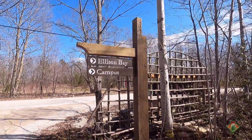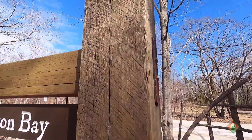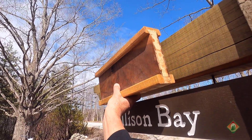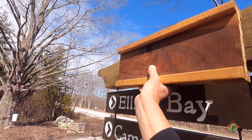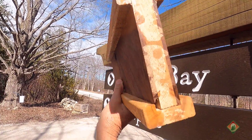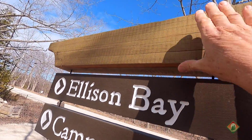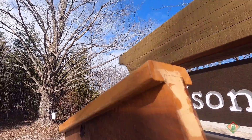Here's what happens — we had to go with a double bolt on that one because there was such a tremendous amount of stress, since the beam itself has weight to it. This is why a lot of I-beam stuff came into existence. Some guy invented it back in 1849, and there's a reason for that: it has the ability to cantilever and span larger distances with reduced weight, because you don't have all that solid wood in the middle. Instead, you just have the top flange, the bottom flange, and then the web.